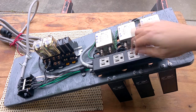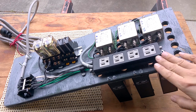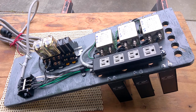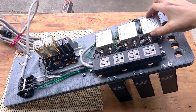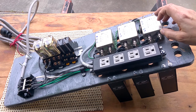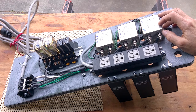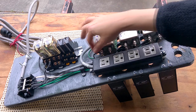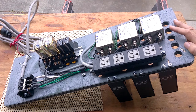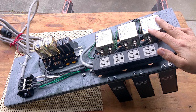In the United States, the white wire is supposed to be neutral and black is supposed to be hot — this outlet was wired incorrectly, though it's not energized. I mounted it with a little gap underneath so air can still flow to the stepper drivers. In between I mounted these little common-mode choke power filters. They have capacitors inside — they're old and used, but I doubt they're electrolytic, so they're probably fine. The cases are grounded and expect a ground wire, which is one deviation from a star ground scenario.